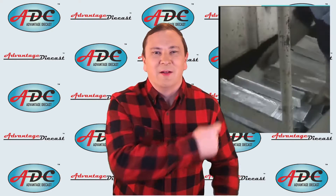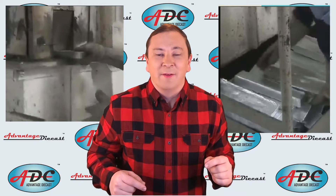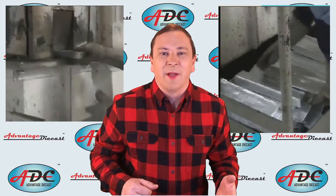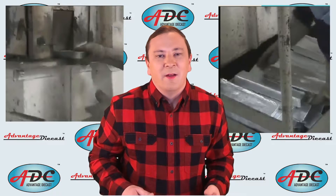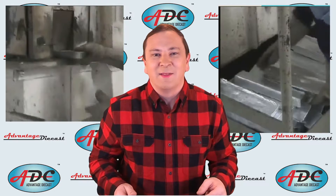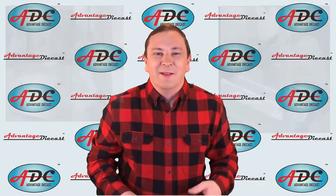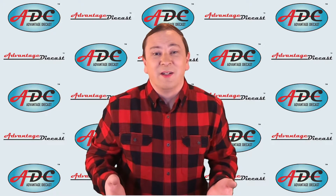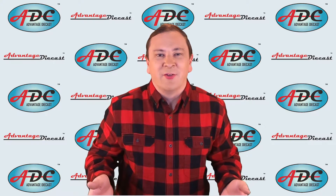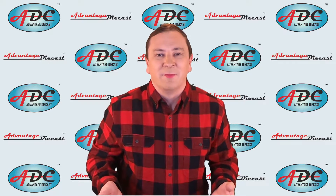These two pictures here show metal being dropped into an electric furnace. This electric furnace is used to melt the metal and make a molten liquid. This molten liquid is forced under pressure into the die cast mold cavity in the die casting machine. The mold is then cooled, which solidifies the metal, making the hard part. The mold is then opened, the part is shoved out and dropped. The process continues to repeat itself until the right number of parts are made.